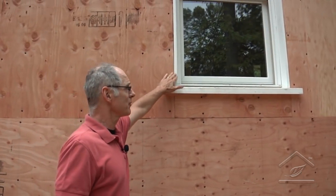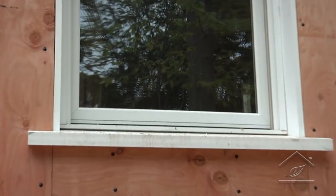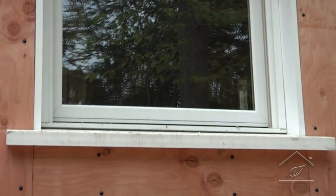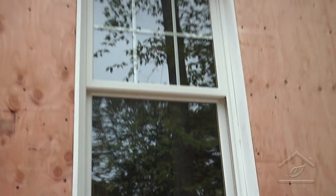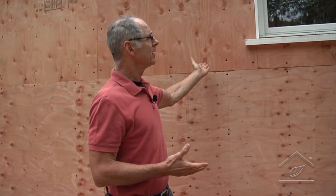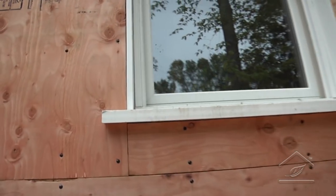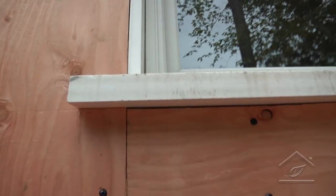Because of the way we built it up with all that rigid insulation, we had to make extension jambs for the windows. The idea is I want to be able to put my casing around the windows, trim everything out, and have it look conventional. We split the difference between how thick the wall is from inside to outside, so it doesn't look noticeably different on either side.